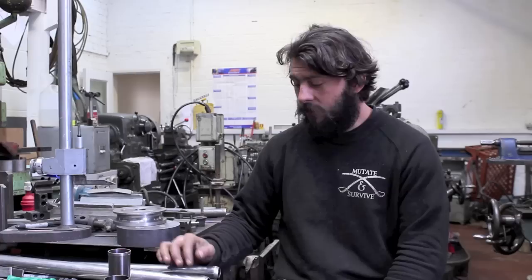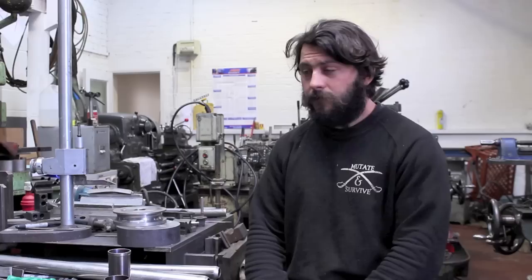At the moment it's early stages with the testing. I've just built the first test road frame with the 921, which has gone for EN testing and passed the road test — which is very exciting. It's the first time I've had a frame tested to EN standards. That's with TIG welded Nitronic 40 wire. I'm not sure about the compatibility issues joining that to 953 or 931.